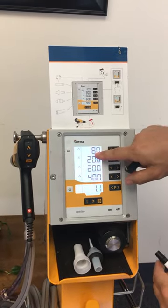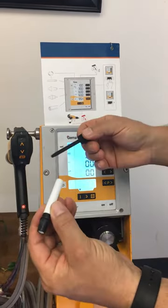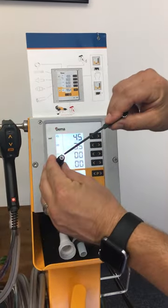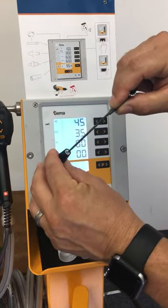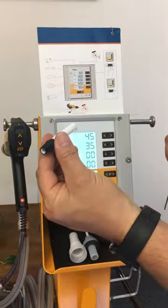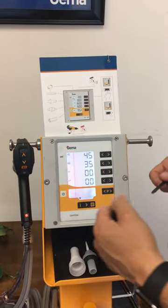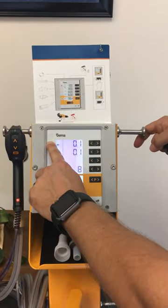Today we'll look at this one first — the insert. To check it we're going to pull the tool out, check the gauge, and test it to see if it's bad on this side. We'll also look on the other side for any oblong wearing or any buildup. If it is bad, we'll take it out and replace it. If it's still good, we'll put the part back in and continue to use it for a couple more days, then come back and check it again.